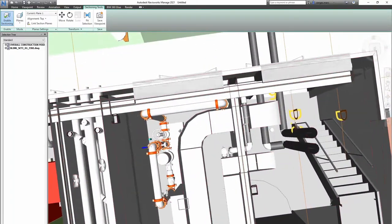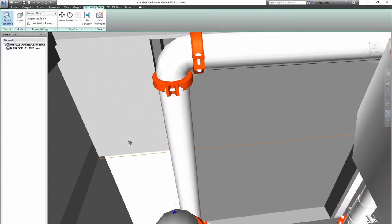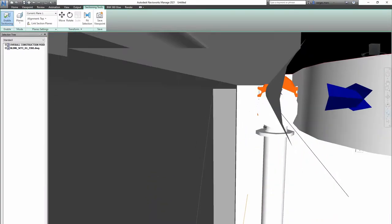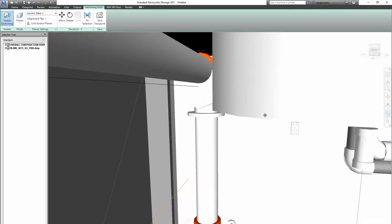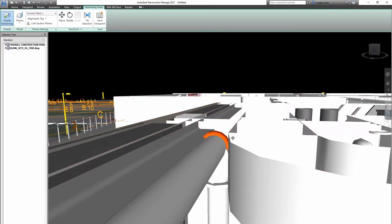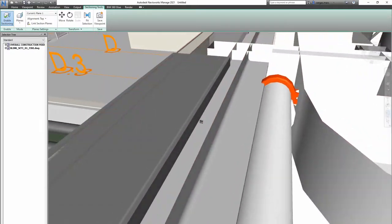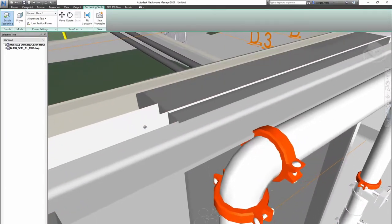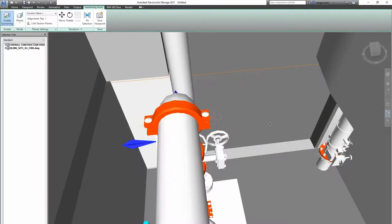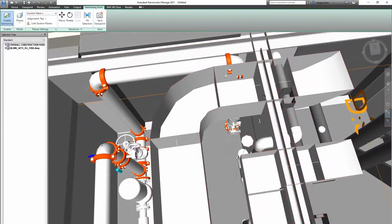Now, it looks like I might be conflicting with something here. Just so they have it so close to the door that they might ask us to clear the steel here. And that might be an issue, but we do need that 10 pipe lengths, the 10 times the pipe diameter. So we'll have to figure that out. They may end up having to scoot us in a little bit or relocate this ductwork here, because you can see right here we're also into that ductwork with our coupling.